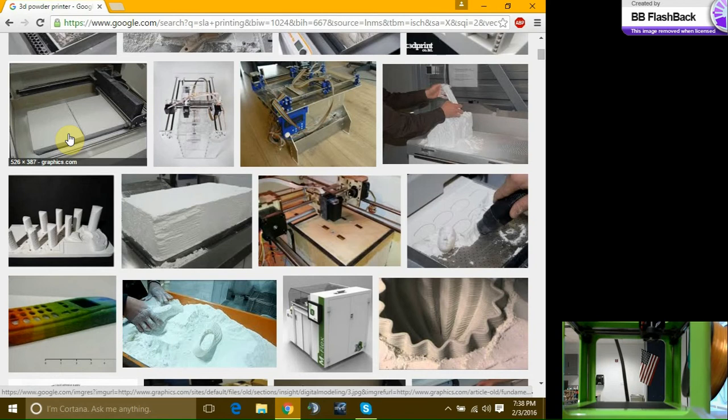And then as the squeegee goes to the other side, there is an ink cartridge that a normal printer uses, but you bleed the ink through, and then you send a glue through it, and it prints out the glue, like it would if it was printing out paper. And then it will repeat the process until you have built up a part. And then it's really messy because then you have a vat of sand that you have to carefully, archaeologically dig out your bone and then try to conserve some of the powder.